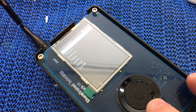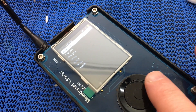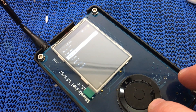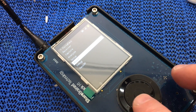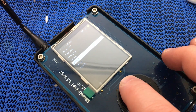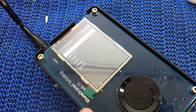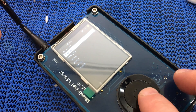Let me zoom in. The main feature here is a jog button — you can jog up and down and left and right. In the center you've got a tuning wheel which you can spin around. You can hear it clicking — it will go up and down the menu, or it will tune your VFO, or you can change other variables.